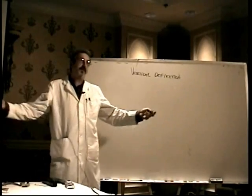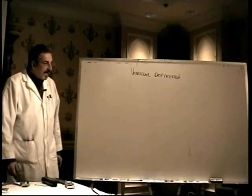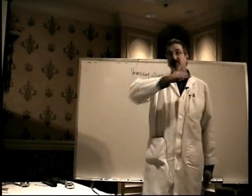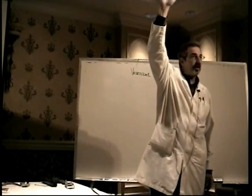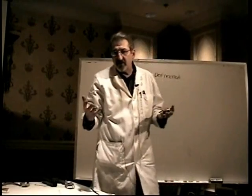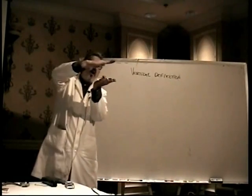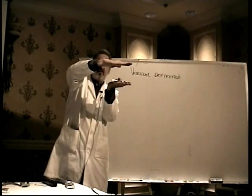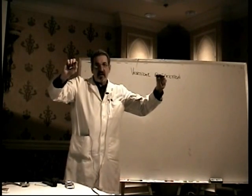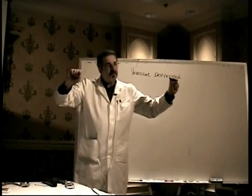I just take a picture of it just for the heck of it. And it's really, really common. How many of you have seen loss of vertical deflection, just a horizontal line on the screen? Okay. Other vertical deflection failures are where the image just doesn't fill the screen fully. Where you have total catastrophic loss of vertical deflection, you just have a horizontal line on the screen.